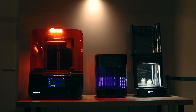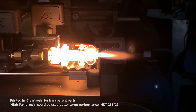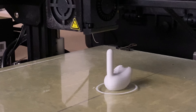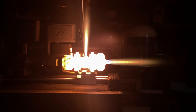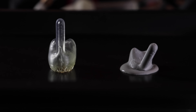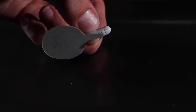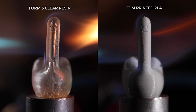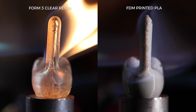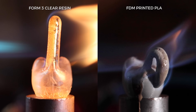This chamber was 3D printed in resin on a Formlabs Form 3. As we test, the nozzle throat slowly erodes due to the high temperature. If we were to 3D print this on a normal FDM printer in thermoplastic, the parts would melt and become unusable as soon as they became warm or hot. This shows the difference between a resin print and a thermoplastic print on a hot plate — the resin part keeps its shape, but the plastic part melts. Under a blowtorch, the resin part ablates, meaning it burns away a surface layer but remains mostly intact, while the printed thermoplastic part melts, losing its form.